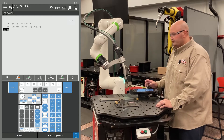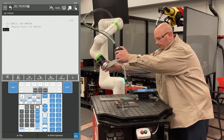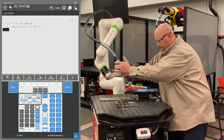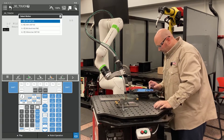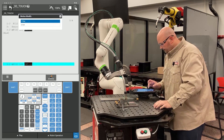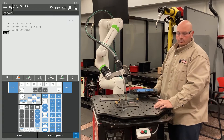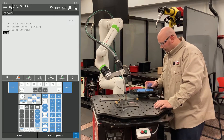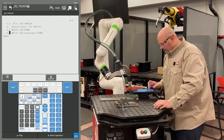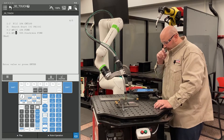Now I'm going to get my robot into position for my search. I'm going to start with my Y search and bring my robot down into location. I'm going to record a point there. The first point is going to be a J motion with a fine termination — this gets my robot to that location. The second location is the same point with an L move, a linear move with a fine termination. I'm also going to change that position ID number to match my approach position for my search.